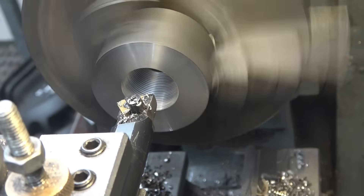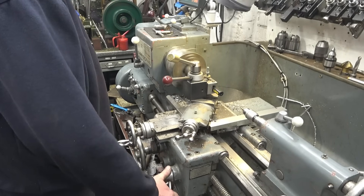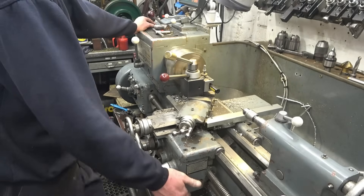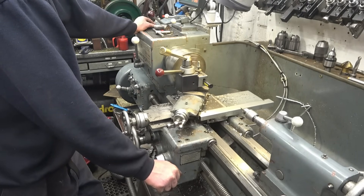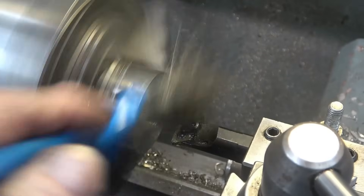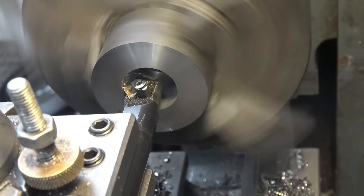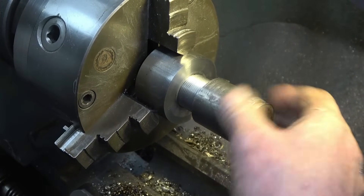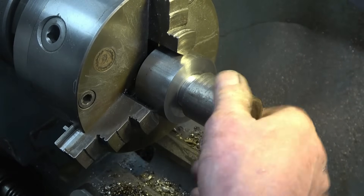Just taking a little light cut — I'm not going to rush this. You always keep your hand on the lever when screw cutting. Always. We'll be getting near now. It fits my test piece. Whether it'll fit the job or not remains to be seen. Not bad — it's a little bit on the slack side, but for what it's got to do I'm sure it'll be alright.